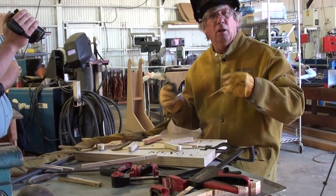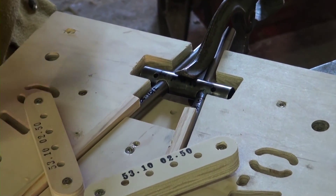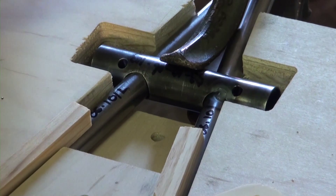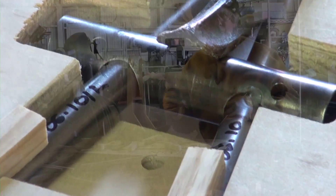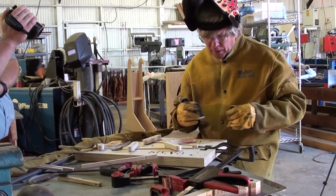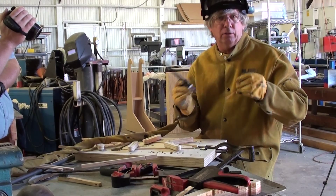You're not going to be welding a lot of welds on these things — we're primarily just looking to tack weld. If you start with too much heat or too much flame, you're going to be burning the wood fixtures a little bit, which isn't really a big deal, but maybe have a spray bottle handy. If you're doing oxy-acetylene, you can have a spray bottle of water so you can wet the plywood between welds. Just go around and tack them — just tacks in different locations.